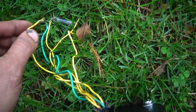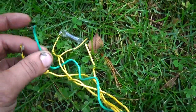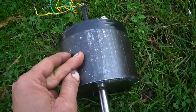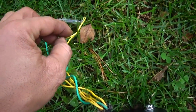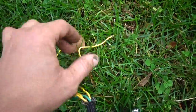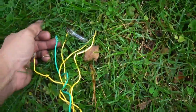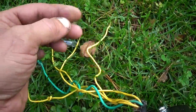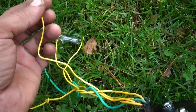You'll find one wire that won't arc because it's a duplicate. A little note about these: the ground wire is almost worthless — there's no use for it at all, because if you fasten this to the engine or to the chassis it's already grounded. These yellow wires only produce AC cross-current between each other. So if you tried to get source-to-ground from one of these yellows to the ground wire to light a bulb, it won't do anything. The current has to flow between the yellow wires themselves. You could get power off one leg to ground only if the other yellows are already hooked up and doing something.